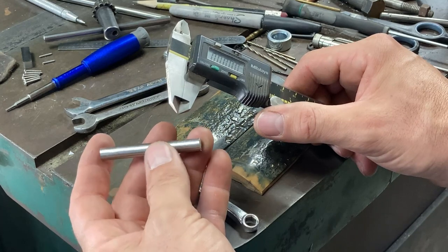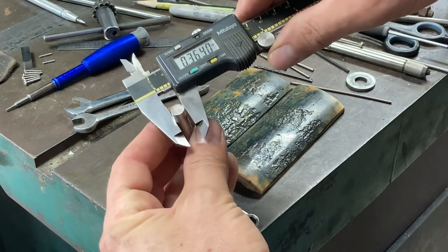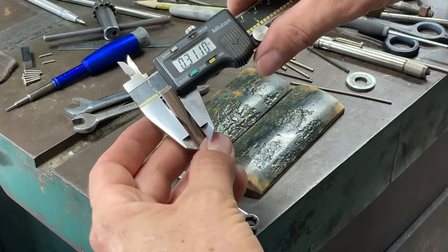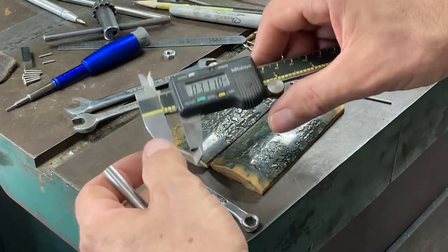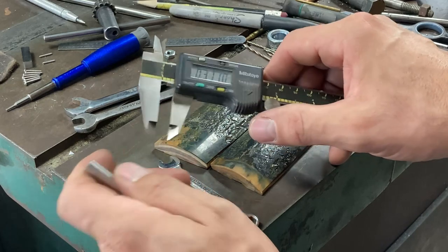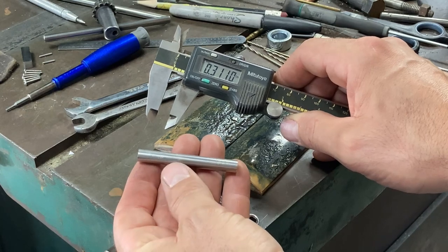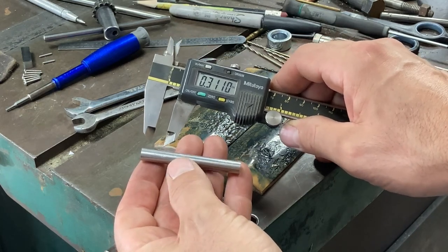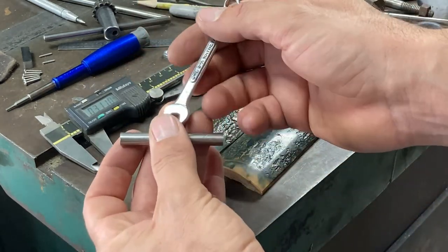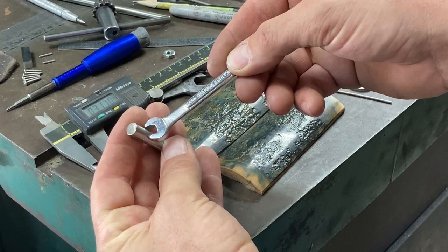We're going to use this nominally 5/16 stainless rod stock. So let's see how big it actually is. Just slightly under, 311, 310. So let's call it 310. That's 60 thousandths of an inch total that would have to come off to get this down to quarter inch, or 30 thousandths per side if we were to turn it off. And I'm thinking about this because if we want to use a quarter inch box wrench on this for final assembly,